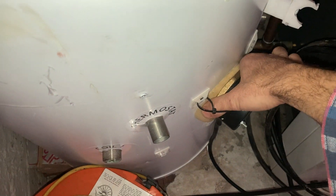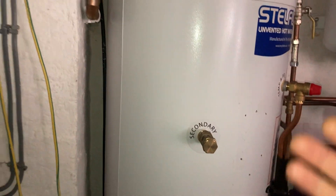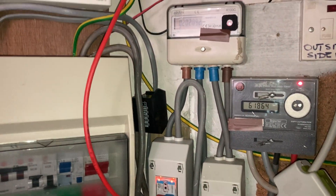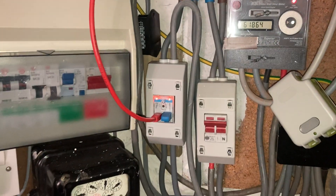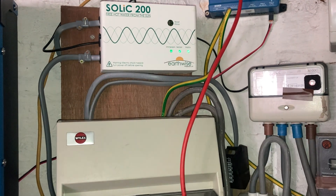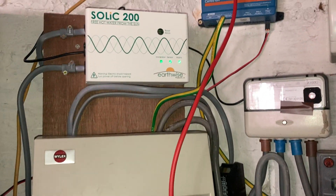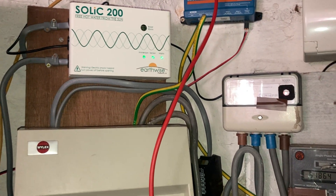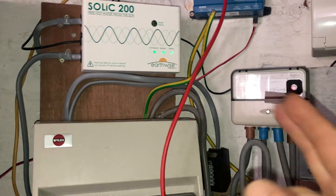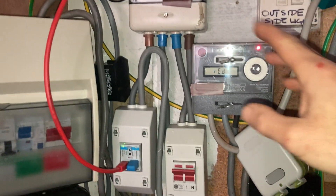I had to turn off the inverter temporarily, just saving the power. It's only been on for about 10 minutes so it's not even getting warm yet, but anything going in there preheats the water before it goes to our combi boiler. The conclusion is that I think the Solic works. I think it works best when there's a huge surplus of solar — we're talking over a kilowatt. When it's hovering around 100 watts of surplus it doesn't have much of a buffer; it tries to regulate to zero and if the sun's flicking in and out behind clouds it confuses everything.